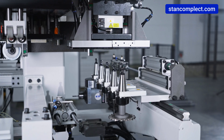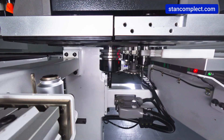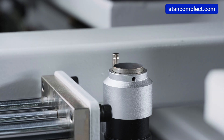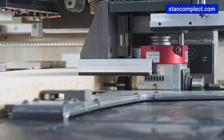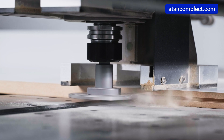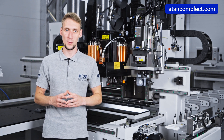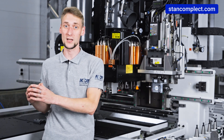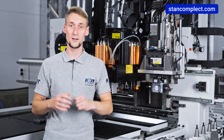The upper milling unit can quick-change tools to five different positions, significantly improving functionality. The upper spindle is equipped with a tool measurement sensor, which saves setup time and ensures accuracy control. The machine also includes four chucks and a horizontal unit with an X-axis grooving saw blade, providing additional machining options. These milling capabilities make it a versatile tool, allowing customers to perform milling operations and reduce overall workpiece manufacturing time.